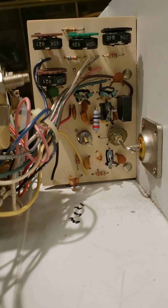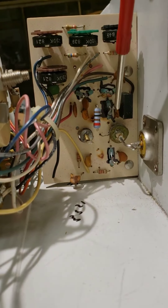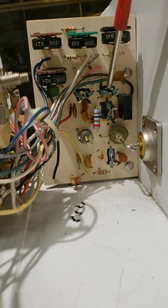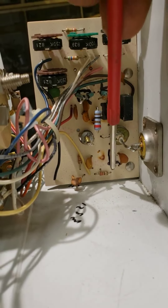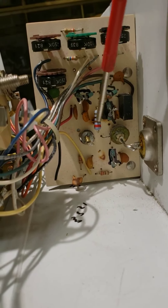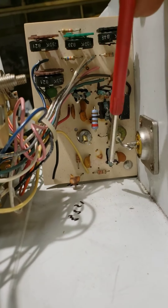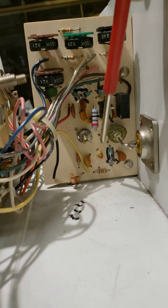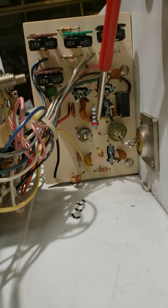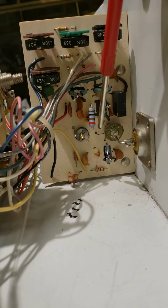What I found out was all these diodes are switching diodes. They got two of them tied together — one, two, three, four. And the 100 ohm resistors go bad in them, I guess from putting a lot of watts in them. There was supposed to be a 100 ohm there. I think I used one watt, but I think what was normally in them is a quarter watt.